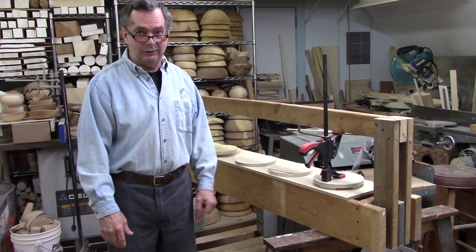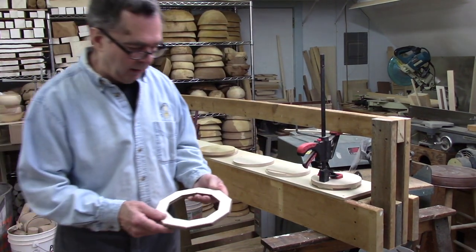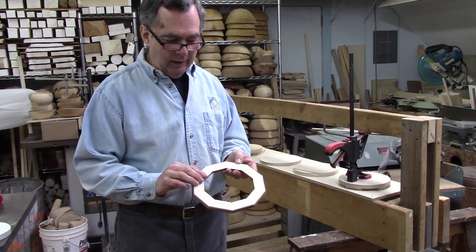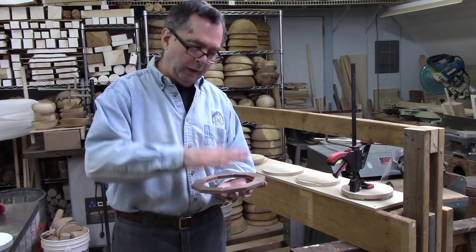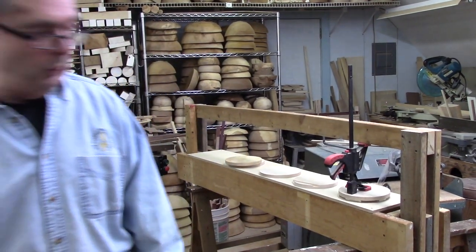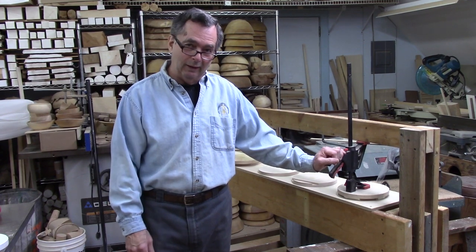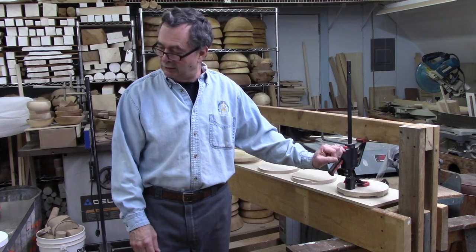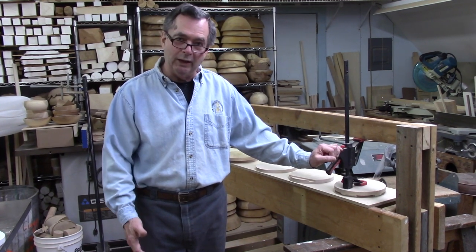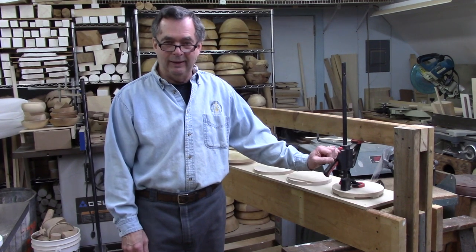That's the process for a single ring. Once it comes out of the press, it'll look like this — obviously solid. I've already flattened one side on this one. You always have to flatten one side, and that'll be glued onto a ring I've already flattened on the lathe, and you keep building from there. I think that concludes my talk for today. Thank you for joining me — certainly hit the like button, and welcome to the Guild of New Hampshire Woodworkers. I hope to do some follow-up videos on cutting these segments and how I get them to length, and more details I haven't covered today. Signing off — I'll see you next time.